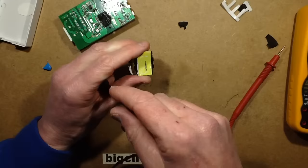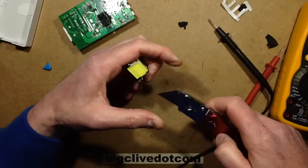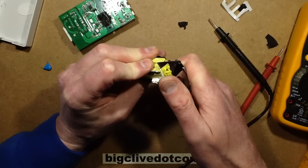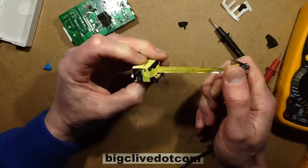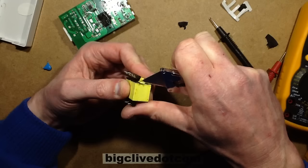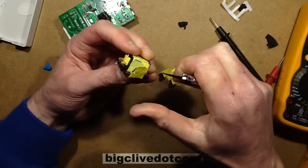Well, that was quite a hard transformer to remove, and rather annoyingly the fault is now cleared. Certainly there's nothing left between here, so we've lost continuity over to that side — so it's been the transformer. But testing between the windings the fault has cleared, and that suggests it's not some sort of direct winding error — it sounds more like an actual short circuit in the windings. So let's proceed further and open this up to see if we can find where that short is.